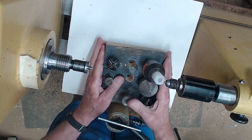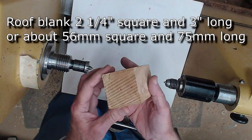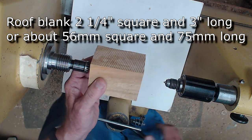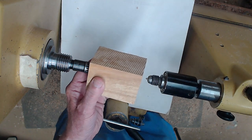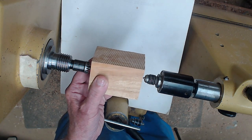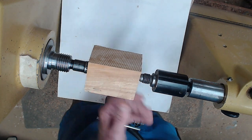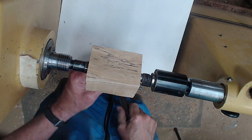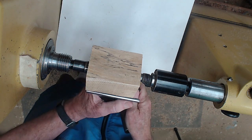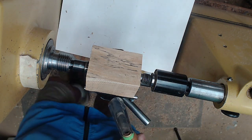So we're going to move this display out of the way. We're going to start off with a piece of wood for the roof — about 2¼ by 2¼ by 3 inches. Sometimes I'm a metric guy, but most of the time I'm imperial unless I'm doing fine measurements. Then I like to use millimeters, because it's a lot easier to figure out half of 97 millimeters instead of half of 2⅞. We're going to turn that between centers using a small tool rest.